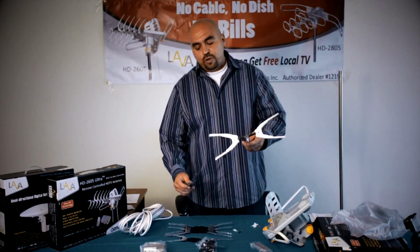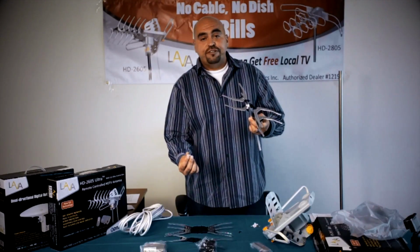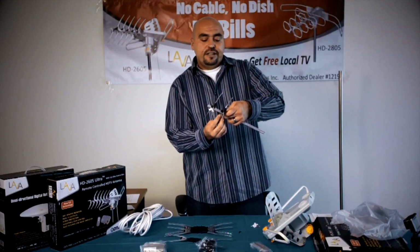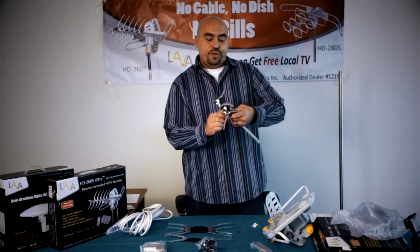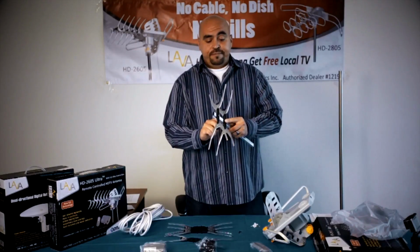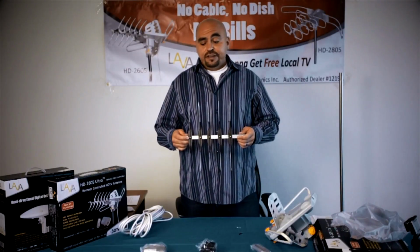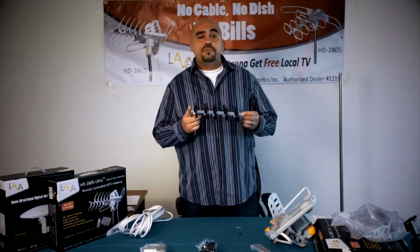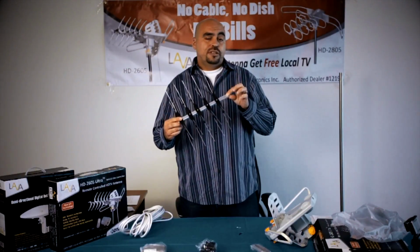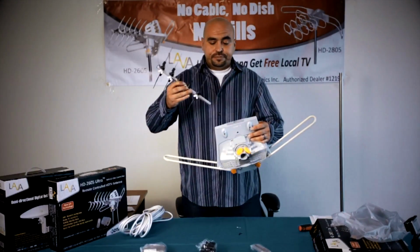Once you have it like that, go ahead and continue with the other U frequency vibrators, just the same way, using the butterfly screw, going upwards through the aluminum square pipe hole, aligning it to the U frequency vibrator, and threading it onto it. Do the same step for all U frequency vibrators. Once you have completed assembling the U frequency vibrators on the aluminum square pipe, it's going to look like this. And you'll still have one more hole exposed, and that's where we're going to move on to the next step, attaching the aluminum square pipe to the main unit.